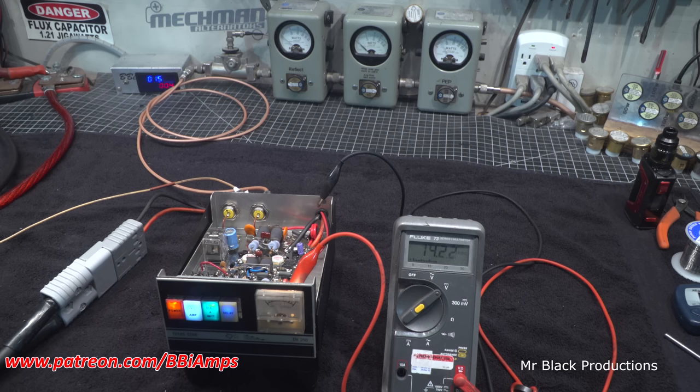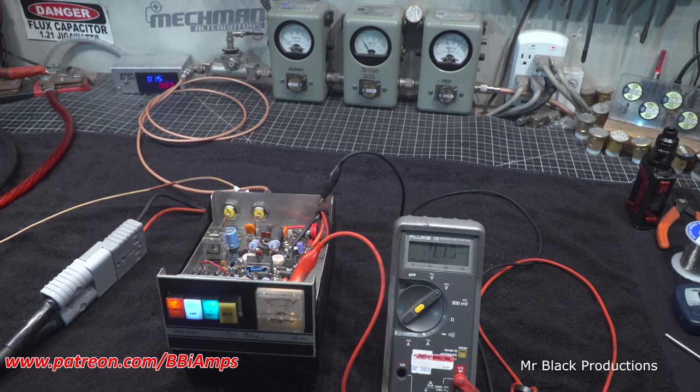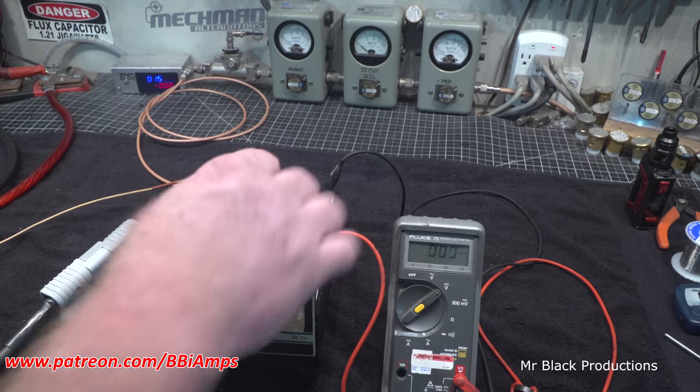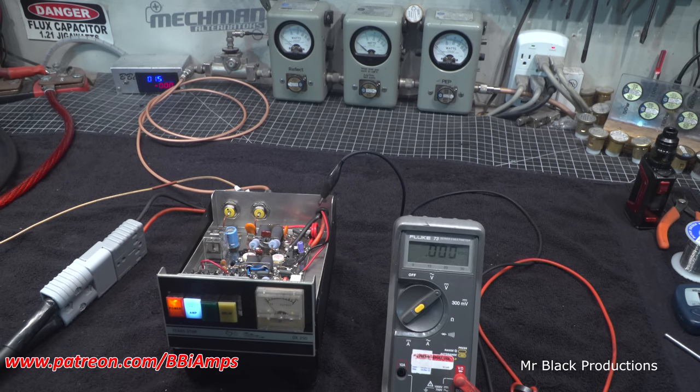Hello, Mr. George. What did you pay for these, men? I think you pay too much. Hello, 1212. You're getting a full volt and a half drop internally on the box. So if we didn't have the oversized power wire, I'd be dropping like 2 full volts.